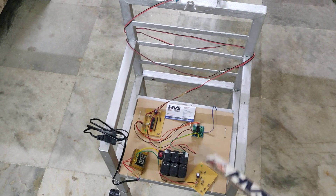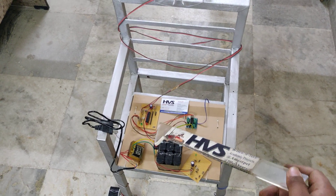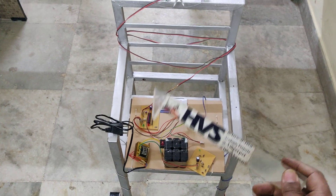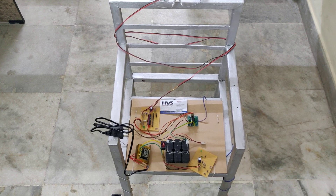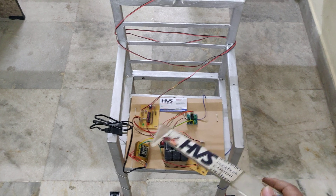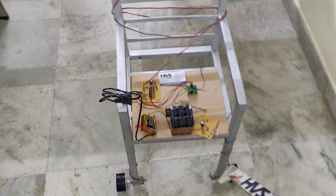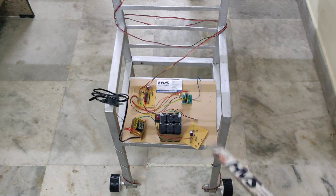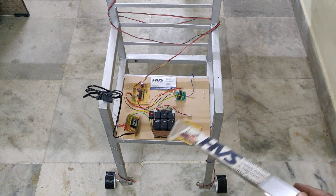Based on this voltage difference, the microcontroller starts a counter which counts the number of blinks per second using a timer. The blinking signal is given as input to the A4 pin of our PIC16F72 microcontroller. Based on the blinking rate per second, the system controls the wheels of the wheelchair in four directions with four operations: forward, left, right, and stop.